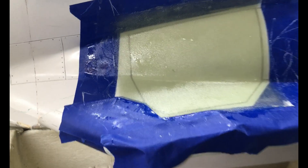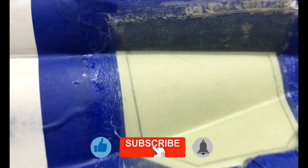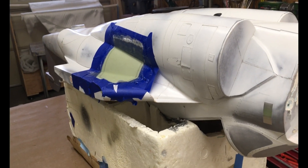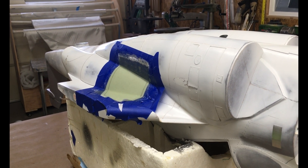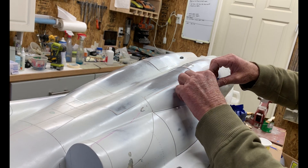The right side is finished. I used four layers of six-ounce, two layers of two-ounce, and one layer of three-quarter ounce for the first layer — this is the left side of the fuselage. Total time to do this: 35 minutes. These surface molds are really easy and quick to do. We'll let that cure for the next 24 hours or so, maybe a little longer because it's cold.